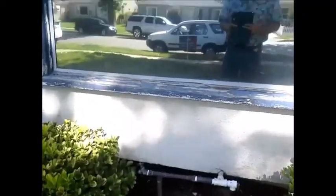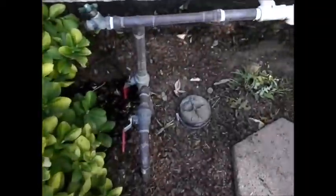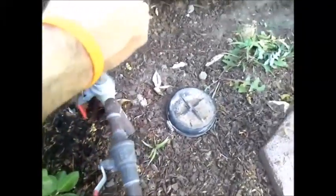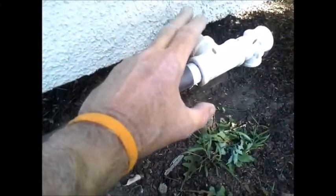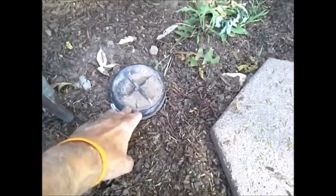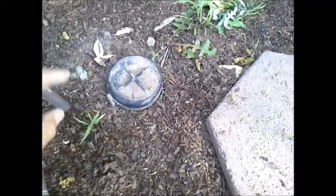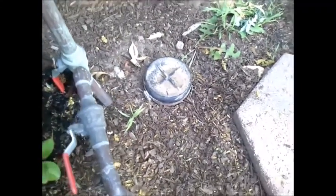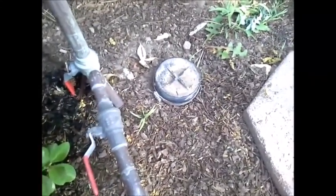gas, and power. So at the very front of the house, there's a handle here, and this is your main shut-off valve here. Copper coming up from the street, and when it goes into the house, transitions into galvanized. So that's probably original. There is a 4-inch main clean-out, and it typically means there's root problems, and that's what the buyer's plumber had told them as well when they did a snake test.